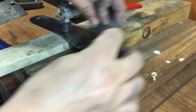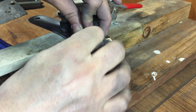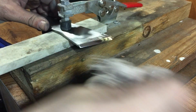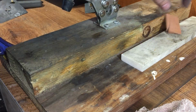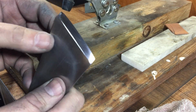Now after I was done with the glass, it was back to the clamp. I feel like I have more control here. I used a smaller file to hold steady the sandpaper as I went up through the higher grits. Again, the file kept my contact on the blade as flat as possible, and I worked that edge until it was shaving sharp. I'll save you the image of exactly where I tested the sharpness of this thing.